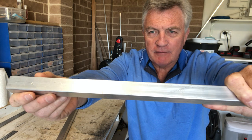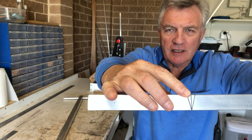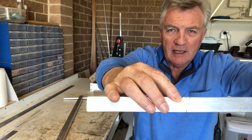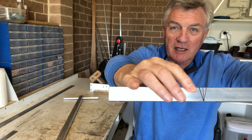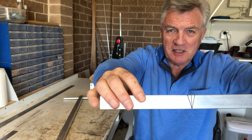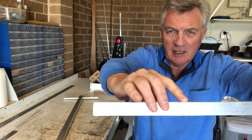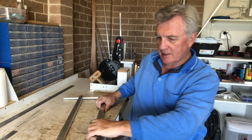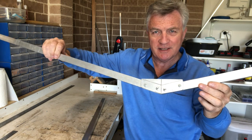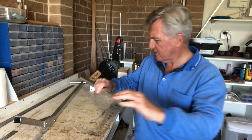I'm just about to cut. You can see I've got a 90 degree line and then two lines out here, and that total angle makes something like 15 degrees. The easy way to do that rather than trying to measure out 15 degrees is to just come 6mm either side of the upright. Having cut that out we're going to end up with basically that. I've been over to the band saw and cut my notch as just explained, and now I'm just going to bend this up.